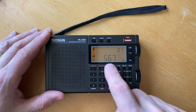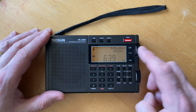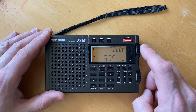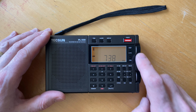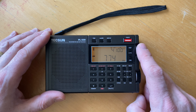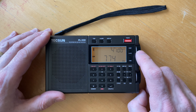Now that's going to be okay on this radio because the AM bandwidth on the Tecsun PL330 is enormous — if you've got someone broadcasting close to hi-fi on medium wave, this will get it, and that limits the effect somewhat. But you can see it's not lining up. This is 640, but we see it at 639, and the reality is we're getting a whole lot less in medium wave than we did before when we had it on the proper step. If you were to lower the AM bandwidth, the situation is even more obvious.